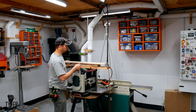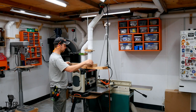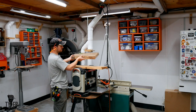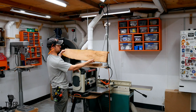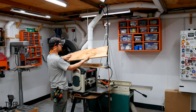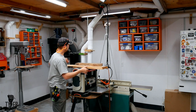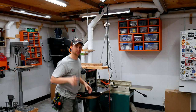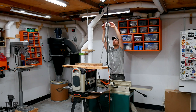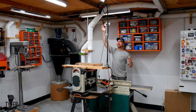Here are the three species of wood I'm going to use: a piece of ash with some nice curl and a knot, which will give us a good baseline; a big piece of maple, which I've jointed one side of; and this super gnarly piece of cherry, which I expect to get wrecked by the straight blades. I jointed the cherry with the spiral cutter head on the jointer and it looks fabulous. I'm going to start the cell phone to track the current and turn it on to get a baseline with just the blade running.